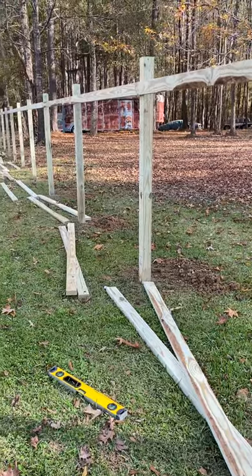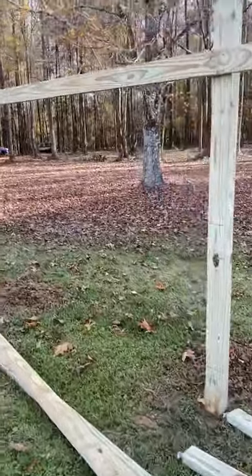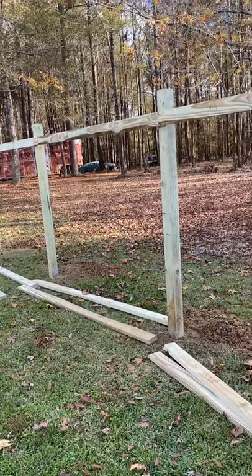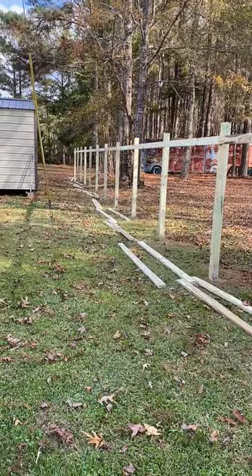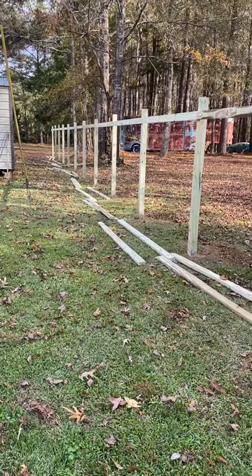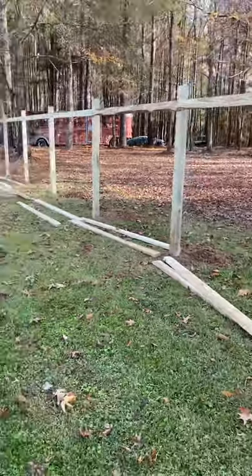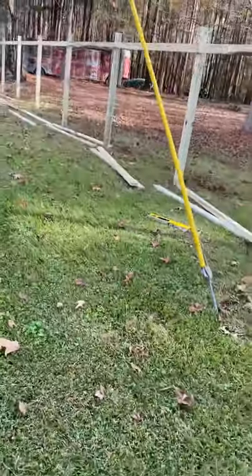Now, when I draw that line and whenever I start installing my fence boards, I don't worry about what the two-by-four looks like at first. Yes, whenever you're going down the line like this, some two-by-fours are going to be up, some are going to be down, some higher, some lower — don't worry about that until you get all of your top two-by-fours set. Once you get them all set, basically just step back, look at it, and adjust accordingly. Some may need to go higher, some may need to go lower.